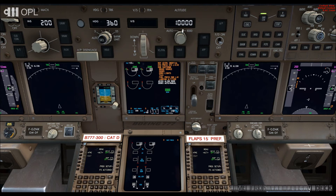Now press the STAT button for STATUS. Verify that the oxygen pressure is at 1850 PSI, and that the TKS inscription in white is at the bottom left. Also verify the hydraulic fluid quantity for the left, center, and right systems. On all three hydraulic circuits, the pressure is currently very low — approximately 50 PSI. This is normal, as the hydraulic circuits are depressurized at this stage of the flight.